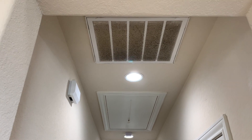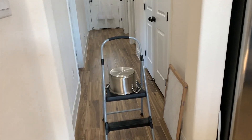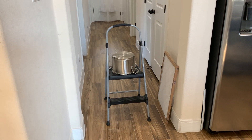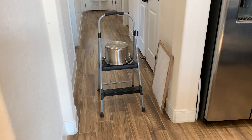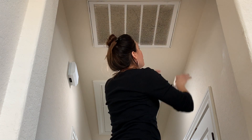That is our super clean, beautiful air vent up there. The latches are on this side and it's going to drop down. This is my setup — I don't have a tall ladder, this is what I've got. Do what's safe for you. I've just taken the plastic off the new filter so far. One important thing to mention: turn off your air conditioner or heater, whatever you've got, and make sure the system is off. You don't want air flowing through your duct without the filter.